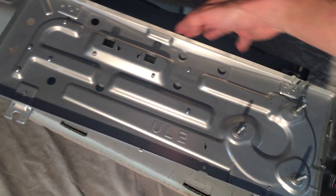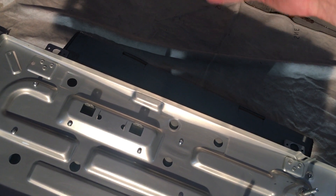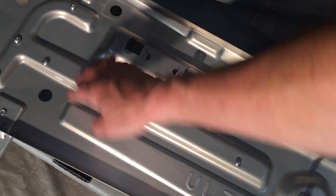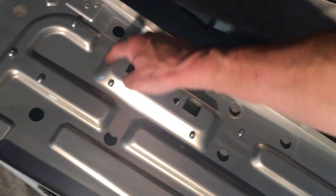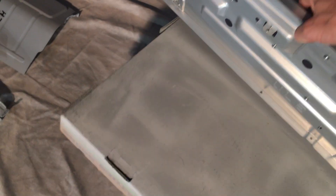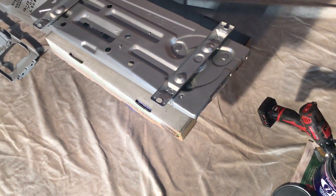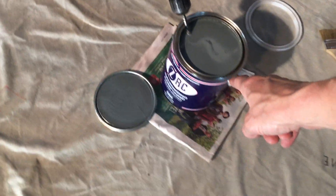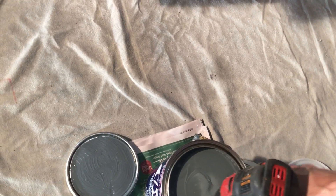This unit will have water sitting in the bottom of it. Where the condenser wraps around, when it sweats down and the fog comes through with the ocean spray, the salts will be sitting down in the bottom, around the nuts, screws, and heating element. So all this will get a more heavy-duty industrial cold galvanizing compound — this can, which weighs 28 pounds.